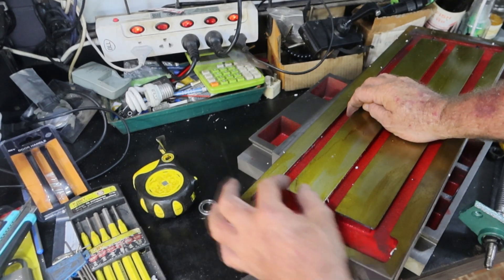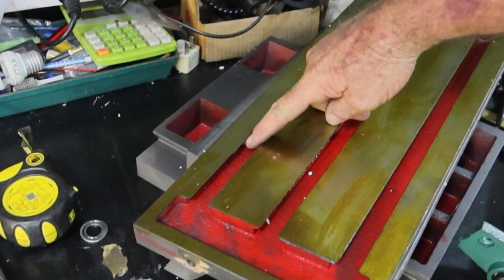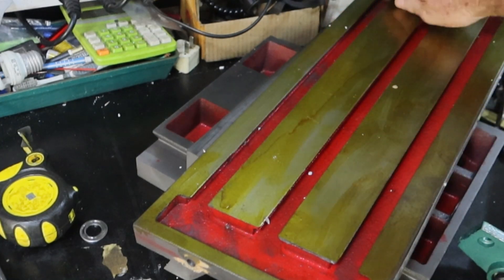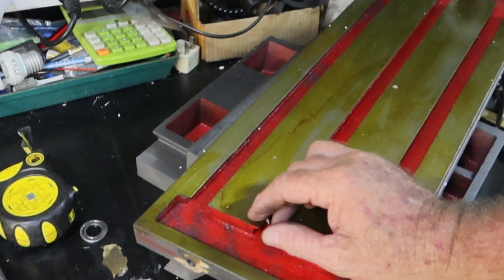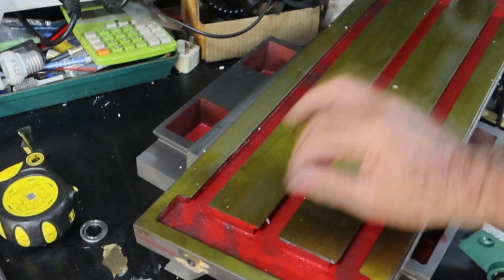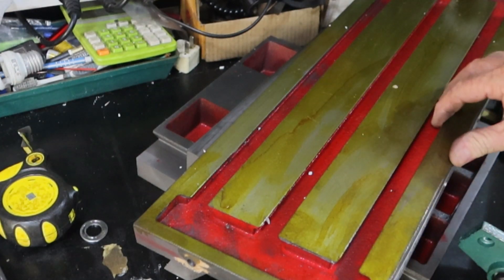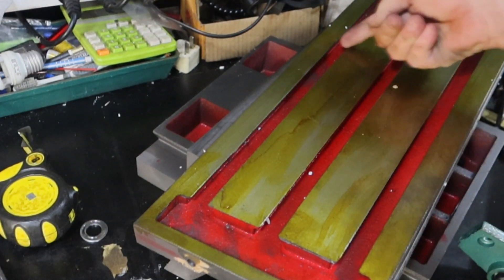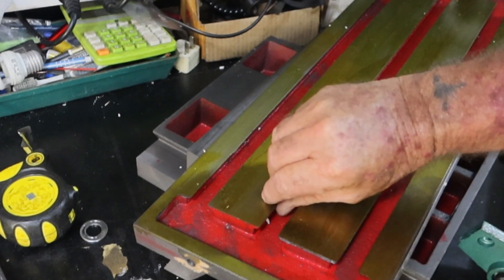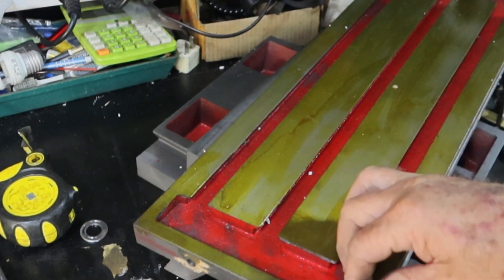It's pretty stupid really — all three of these holes are different sizes, and there's a big lump of casting sitting there with all the edges rough. I don't really know what to do — I can't even think of somewhere I could run an end mill up along these edges just to clean them up a bit. I might just have to run a file down them and sort of try and clean them up a little bit. They're actually tapered in this direction — it's really hopeless — but anyway we'll get on with that.